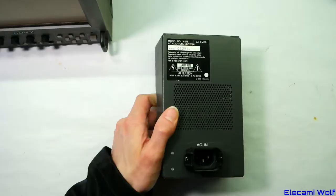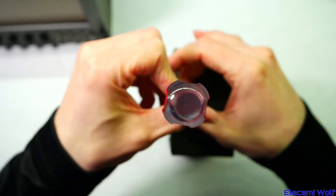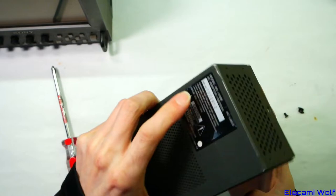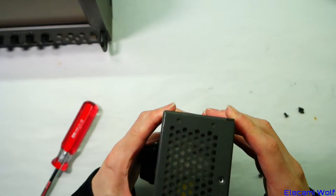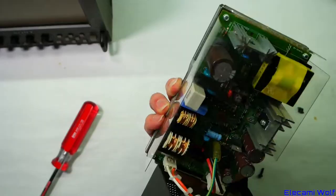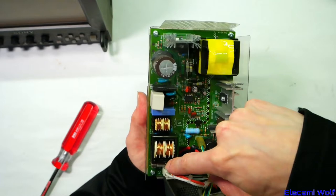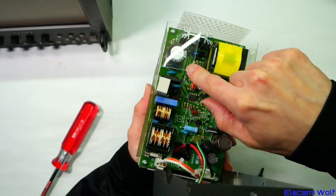Let's start by looking inside the Sony's power supply. It has arrows pointing to screws. Inside we can see it's a switch-mode supply with AC input, fuse, filtering, and inrush limiting. There's a rectifier, main capacitor — 450 volts, 150 microfarads, Nippon Chemicon. The output capacitors include a Sam Young and some Panasonics. There's an output filter with capacitors and inductors, a control IC, feedback optocoupler, main switching device, transformer, output rectifier.